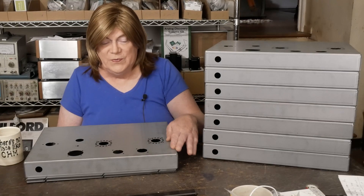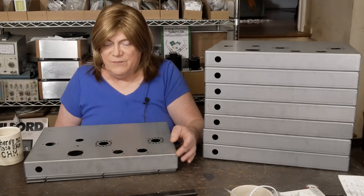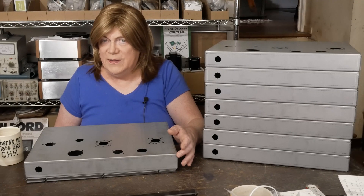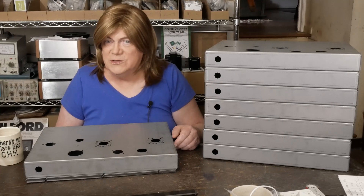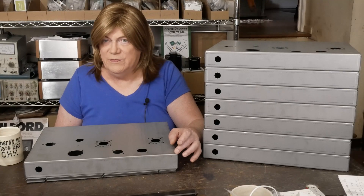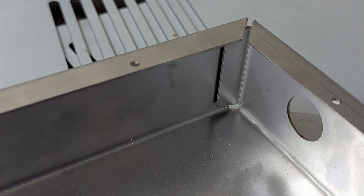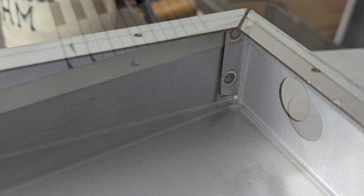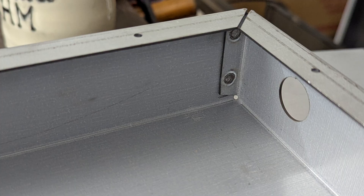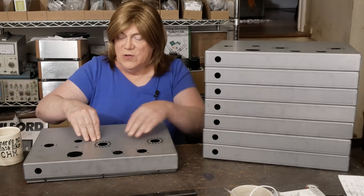Here's the chassis — they did it in an interesting-looking metal. I think he called it 'paint ready.' It's a little more matte finish than some other metals I've seen, but he said this stuff is really good because it has a tooth that'll hold the powder coating really well. The bends are just beautiful — he was able to get this little corner really tight. The original prototype from SendCutSend had a really big corner relief and that just wasn't acceptable. Also, the SendCutSend one wasn't spot-welded in the corners, but these are spot-welded, so they're super heavy duty with no twist at all.